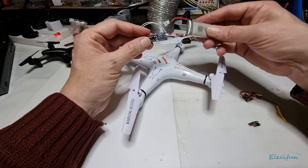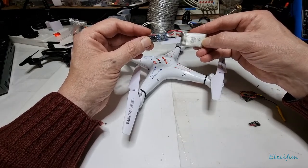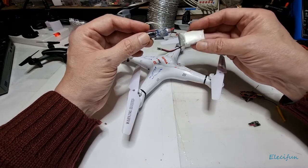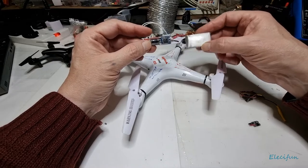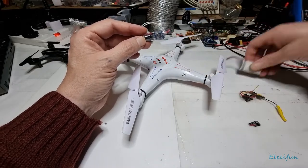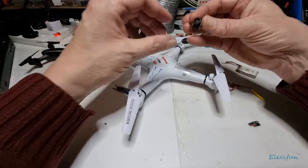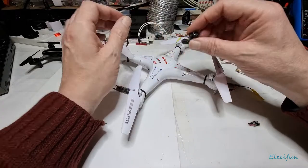The first thing we're going to connect the filter onto is this boost converter, because we need to boost the battery power from a single cell — in this case a 3.7V cell, single cell 25C, 700mAh. It'll go up to 4.2V at the highest charge, but what we need is to boost it to 5V because our camera requires that.